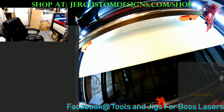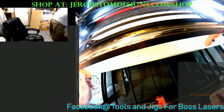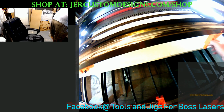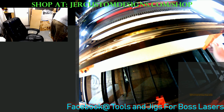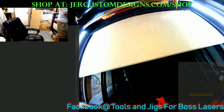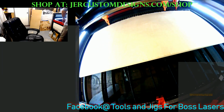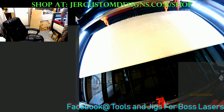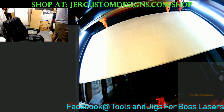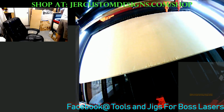Now that my autofocus is done, I want to align everything. What I'm going to do is drop my feet down to a good height so I know where they're at. Fold it up out of the way. Take it down, just so it's catching the edge of the material. I'll go ahead and go to the back of the machine. I'll lower my legs. And then I'll just use the x-axis to straighten the material out. Now the material is straight with the machine, with the gantry. Just flip my legs up out of the way.